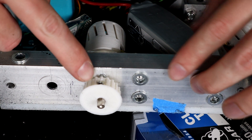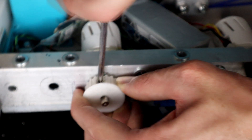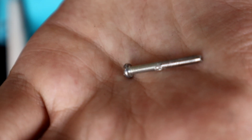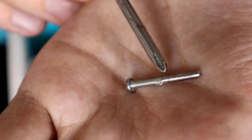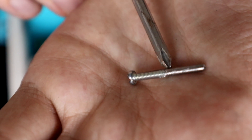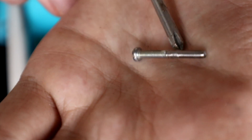I have no idea how visible this is on camera, but our bolt is now pointing basically directly at the flat of the motor — that should not be possible. I am so very confused. Let me pull this bolt out if I can. This bolt is good and proper destroyed. We have threads all the way down until about here, and then after this point all of the threads have been completely stripped and removed. I think the bolt is still the same length it was, but it definitely got just annihilated down this side. We'd probably need a hardened steel bolt to do this and get it to work, because where it's made contact with the actual shaft, it is just annihilated.